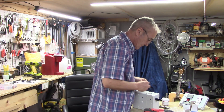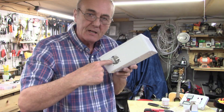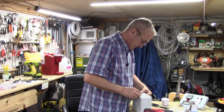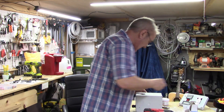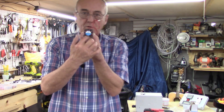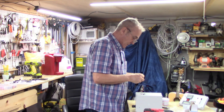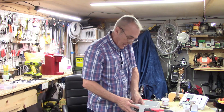Now it's time to add our fan. Before I add the fan, I'll go back to the Dremel — I've got a small circular sand disc, I'll sand this hole just to make it look pretty. When you're attaching the fan, make sure you attach it in the direction you want it to blow. It always blows where you have the sticker — it'll blow in your face if you're looking at the sticker. So in this case, we want that sticker pointed inside. I don't care where you put the wire.